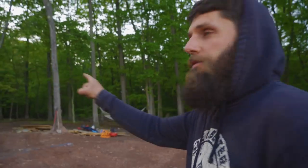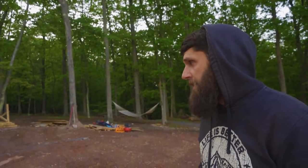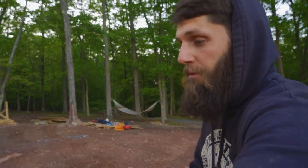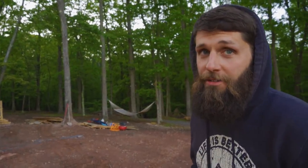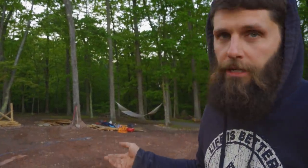From edge to edge up front, it's 24'9", so it should be 24'9" here at the backside, also, where we're standing at. Just because we get 24'9", we move things over, doesn't mean it's square. You know what I mean? Yeah. That's why we gotta measure from this point to that point and that point to that point, make sure it all matches and it's square.